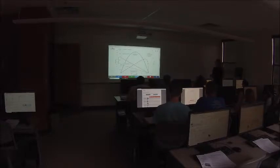So, the thing about DC motors is if you flip the polarity, right? If I hook this wire up to this side of the motor and that wire up to the other side of the motor, it will start rotating in the opposite direction. Okay. With AC motors, that's not quite the case. AC motors typically have three wires instead of two, and it's a little more complicated.